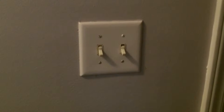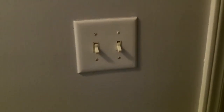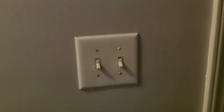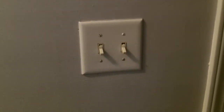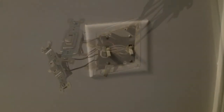This is the switch I'm going to use. There's already some cable running up into the attic - this controls the attic light. So I'll just keep that on the same circuit. I made sure that everything else on this circuit won't be overloaded when I add the fan, which runs at about 4 amps. I'll take this plate off, pull out some wires, and show you from there.